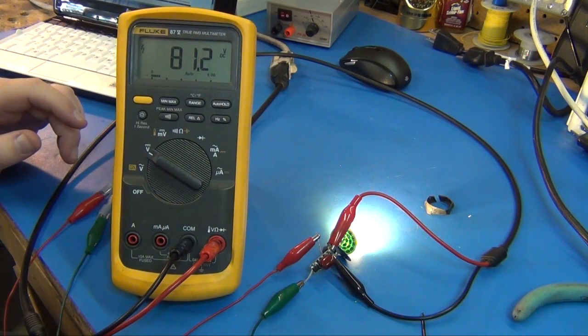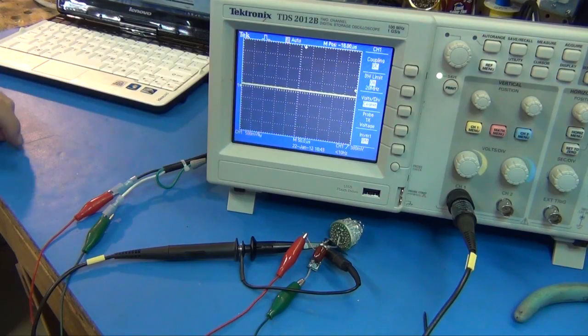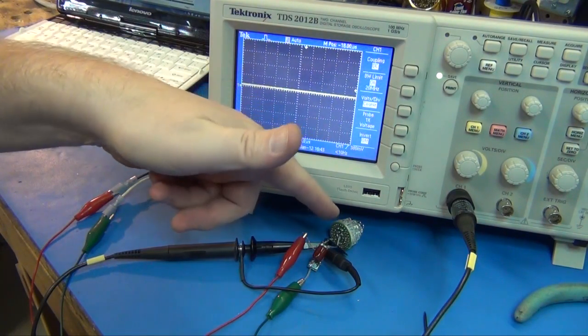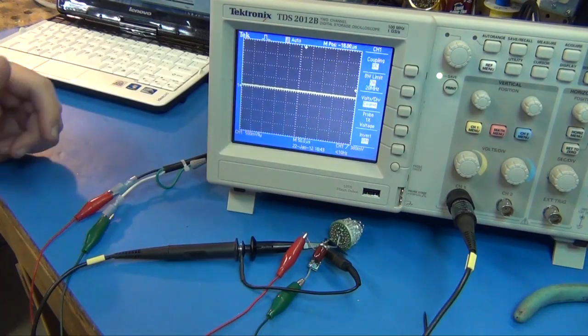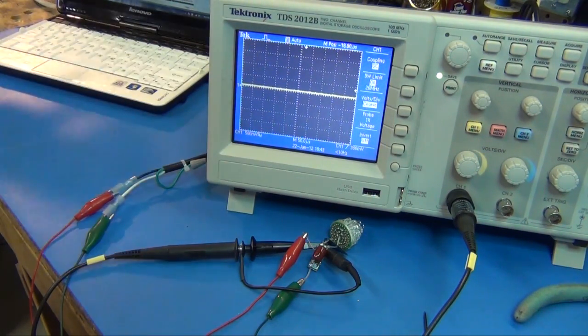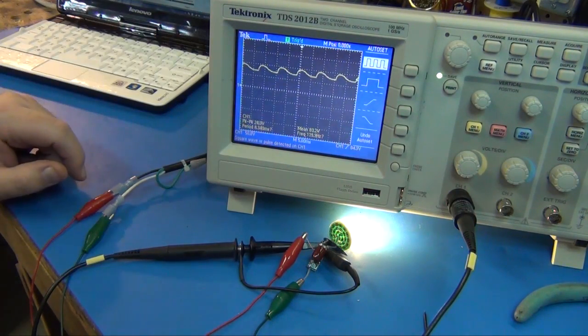That's pretty high. I'm surprised. I was expecting maybe a little bit less. Well, let's see what that looks like on the scope. Okay, we got that same test point right before the LEDs, essentially the voltage conditioning going to those pack LEDs. But I got the oscilloscope this time, so we'll see a little bit there. Let's turn it on. So now we got 50 volts.